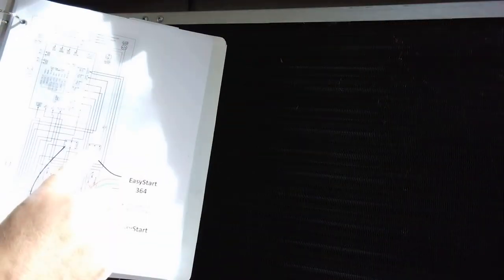So the black wire is going to go to the other relay, number 6 position. So this shows 2 and 4 are blank. So 2 and 4 are blank over here. 6 should be the other thick wire, which is here. If you look at the diagram, follow 6 down. It says yellow wire, I think, but it's not,